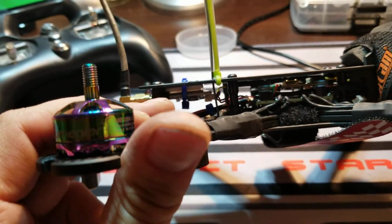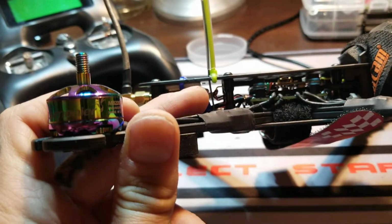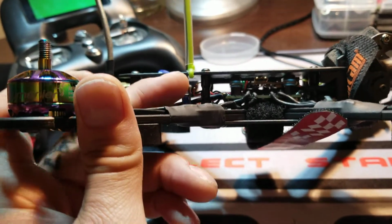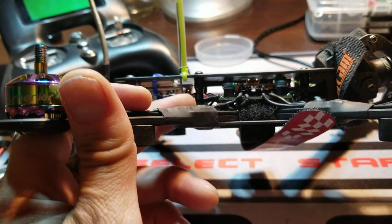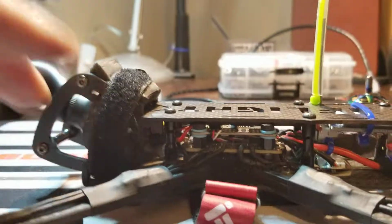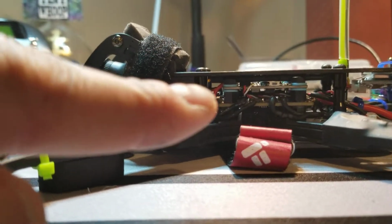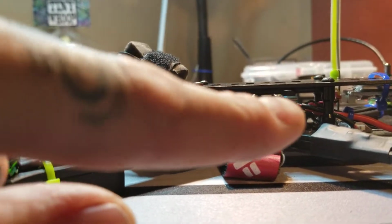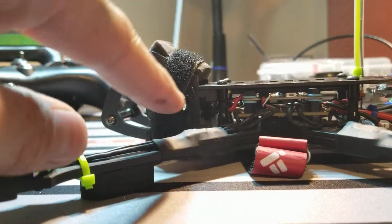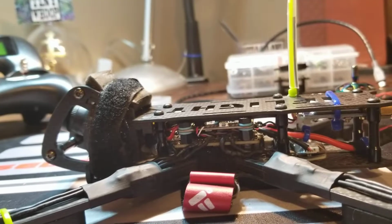I did the Race Band 200 milliwatt Lumenier this time. It's a touch different in size. Other than that, the wires, I did not use a connector, and I did not tuck them back in before I showed it to you. But the power wires have a little extra lead on them that I tucked down up inside here. And then I did the same thing where I used, I don't know if I can even show it to you, yeah, it's hard to see, a black piece of heat shrink that is not heat shrunk that runs across here. If this is your first time seeing this, that's got the yellow video transmission wire running through it, so it's attached safe here and not floating around, and then it's connected with a little bit of extra slack. So I gave everything just a touch extra slack just in case.